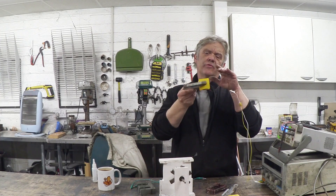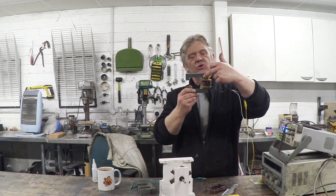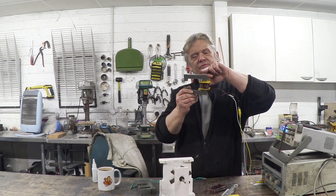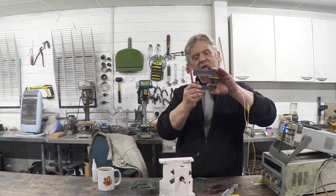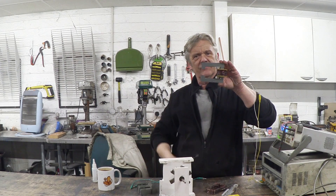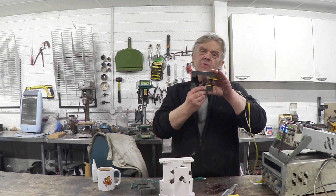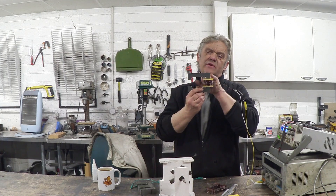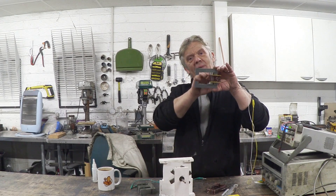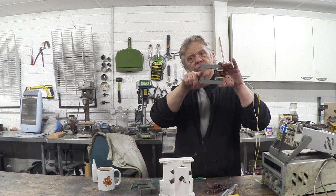On the back of the C we've got a coil wound on there, and then right next to the coil we have some magnets pointing north one way and south the other way. What happens is the field actually follows the path of least reluctance going around this steel. If we pass a current down this coil we can make that side north and that side south, and of course it's already got a north here so the magnetic field has no choice but to be switched along in this direction, concentrating here at this gap.